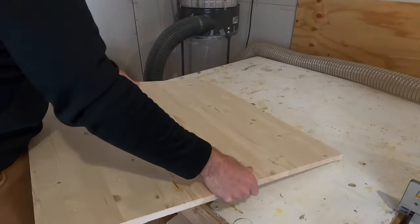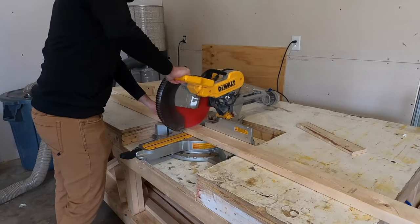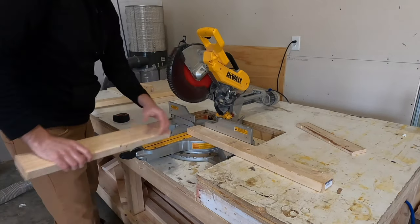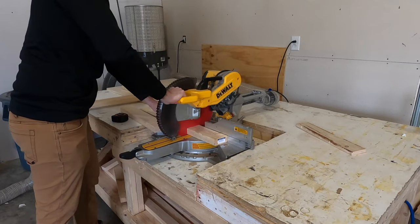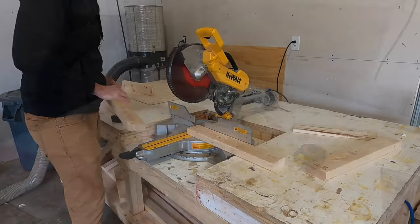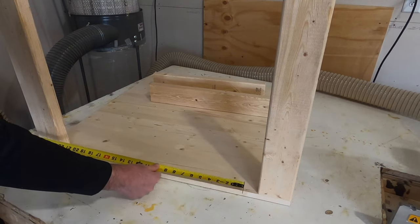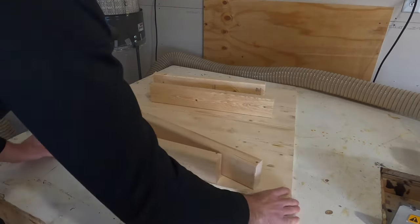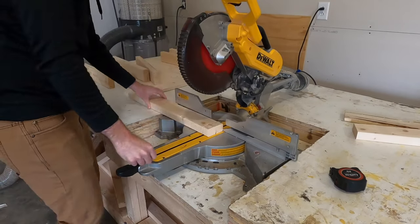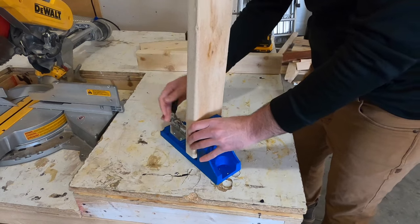Here's a first look at the tabletop. The nice thing is that with those original 16-inch boards, there's only one seam to sand in the middle. With the top finished, it was time to work on the frame. The frame and legs are all made out of 2x4s — you can check the description for all the dimensions and cut lengths I used. I first cross-cut the legs, then set them on the underside of the tabletop and measured the difference between them to determine the side apron length.